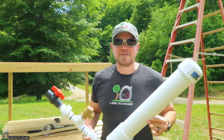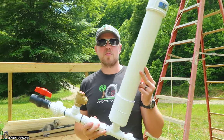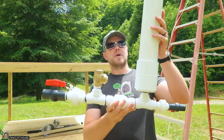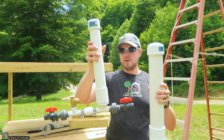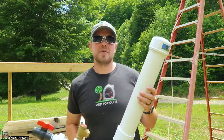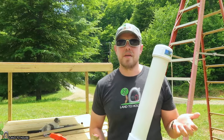A question I'm asked often: will a bigger pump pump higher and produce more water than a smaller pump? This is a one-inch pump, and this, my test pump, is a half-inch. The difference in size is not going to be how high they can lift water, but the volume that they pump.